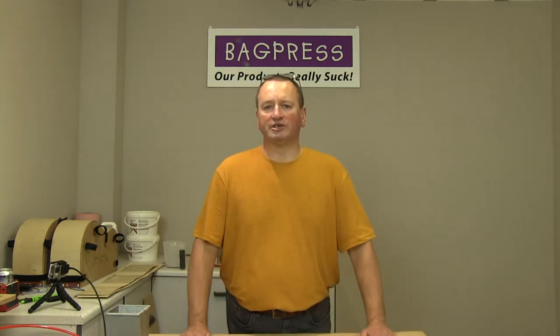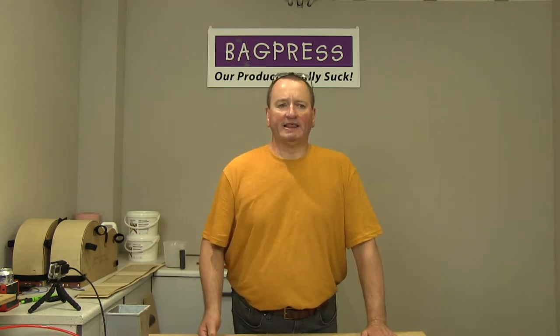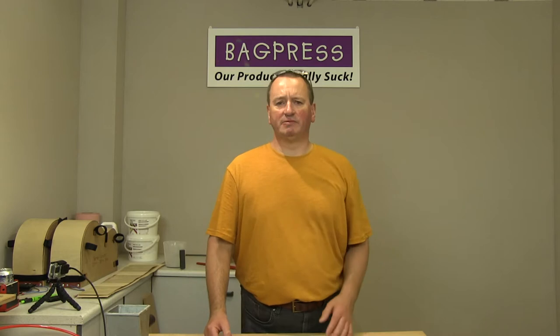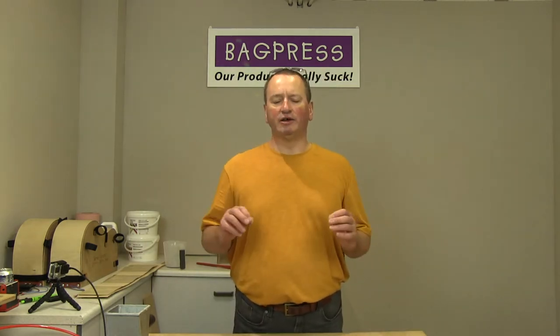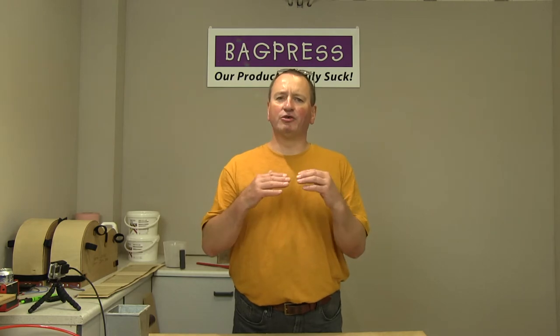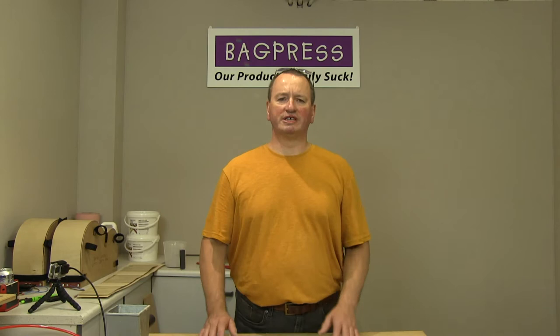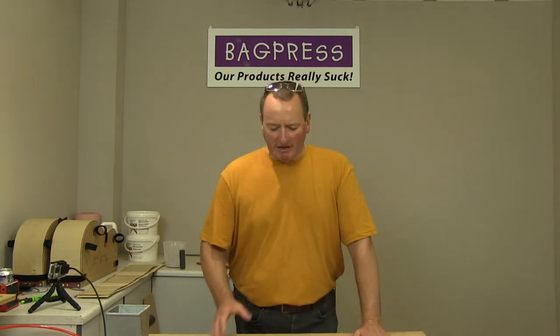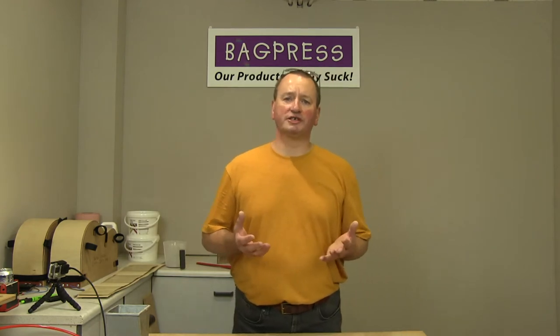UF resins also set very, very hard, I mean crystal hard, and that's important in something like a guitar because you don't want there to be a soft layer of adhesive anywhere or a layer of material that's significantly softer than the wood, because that again will cause a dampening effect. And UF resin cures entirely through a chemical process.